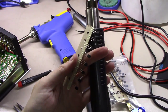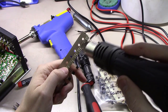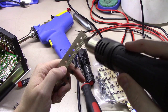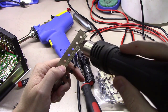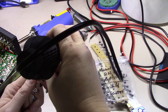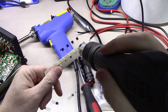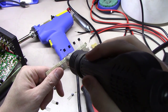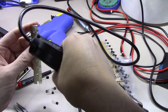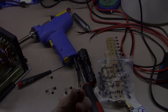These little transistors come on a strip that are glued on with heat-activated tape. I use an SMD rework tool — just a hot air gun — and once these things get hot enough you can just pull a couple right out really easily. Otherwise you risk bending the leads all up. I buy a lot of capacitors in bulk on the same kind of tape as well and strip them myself.